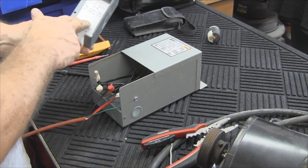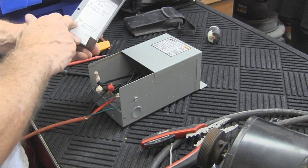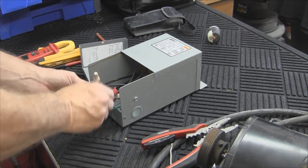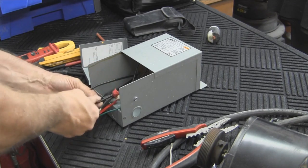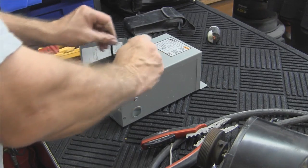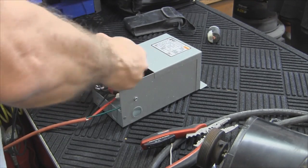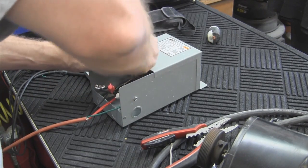This is still wired on the secondary side for 120, so we'll look at the wiring diagram again. The primary is hooked to H1 and H4. On the secondary we want 24 volts, so we need to interconnect X2 to X3, which will allow X1 and X4 to give us our 24 volts. Tying X2 to X3 together under a wire nut. Your neutral will be on X0.